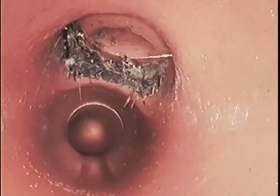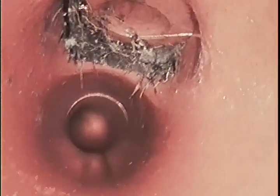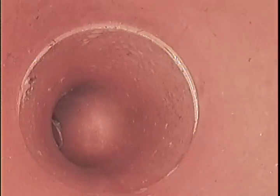There you can see where the tree roots are coming through the inspection there. I suspect this is our main blockage, and I'm going to give it to you in feet so that we're accurate. We're at 51 feet. It's directly above the camera right now at 51 feet. Keep pushing through here. Hello, Doggles.